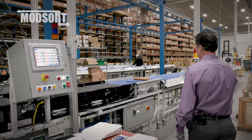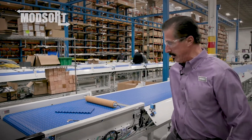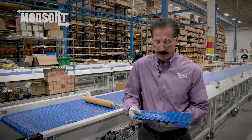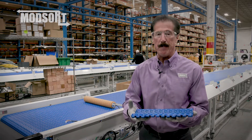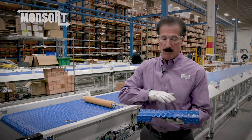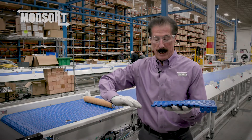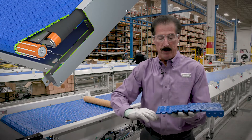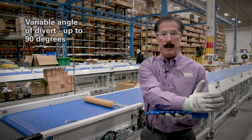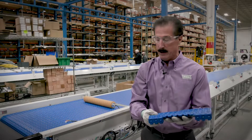Coming on down from this unit, we get to the true mod sort technology. The mod sort technology utilizes our 2253 roller top belt which has evenly spaced balls that, as the belt rolls over a fabric belt, the balls turn and the product on top — whether it's a box, a poly bag, a jiffy, or a flat — will move at twice the speed of the blue belt. Underneath the belt we have a motorized drive roller driven fabric belt at a right angle, and the vector quantity between the speed of that belt and the speed of the top belt can give you a variable divert angle. The balls are omnidirectional and you can get a number of different angles of divert in a mod sort.